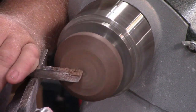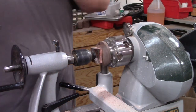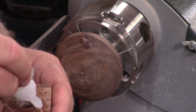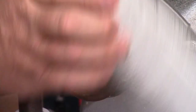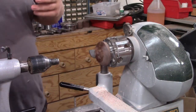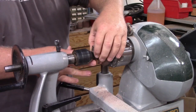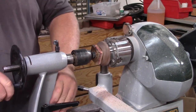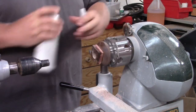This is my waste block — I just put it in my chuck and I'm squaring off the face. I probably use this same block to make about 20 different rings. I'm using a live center in the tailstock to give me a ballpark center, since I drilled this out in the chuck. Then I'm CA gluing it on with thick CA and accelerator — glue on one side, spray the other. Hold it for 10 or 15 seconds and it's good to go.